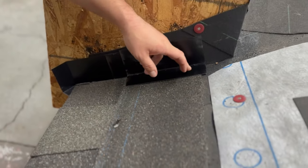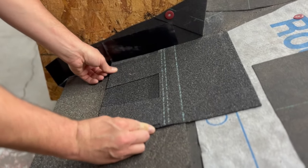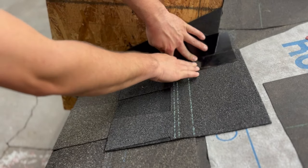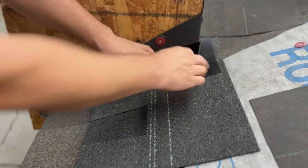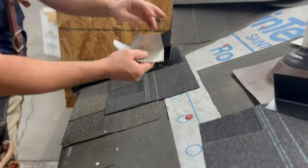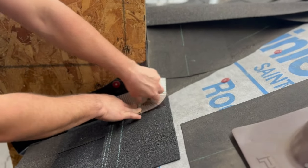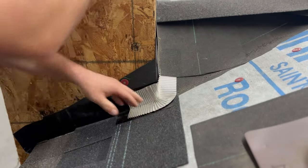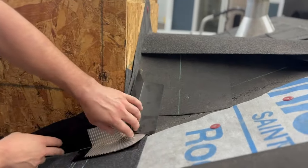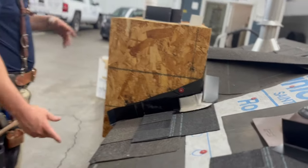You'll pop a nail here and then you would put this shingle over top of that and run another piece just like that. Pop it there, and whenever we go around corners, we use a flexible corner flashing and mold it to fit whatever angle you need. Then your next piece up above comes down just to keep a constant flow of water so that water cannot penetrate or get underneath that. And that is that flashing.